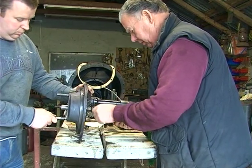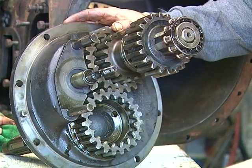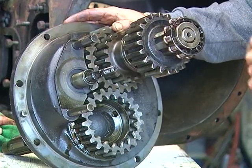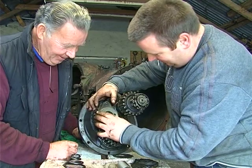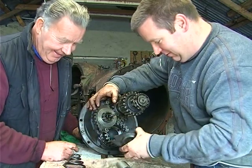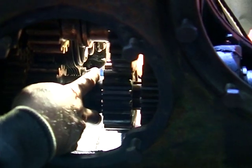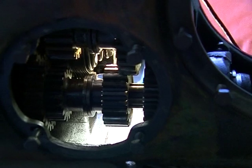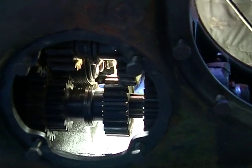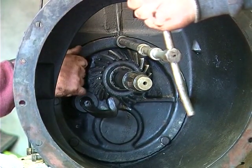Paddy is inserting the brake shaft. The top shaft is fitted to the front gearbox housing. These are the brake plates — having been cleaned and inspected for cracks they are now being fitted. All gear wheels have to be correctly aligned to allow the final assembly. The final assembly of the gearbox has been completed and bolted into place.